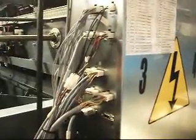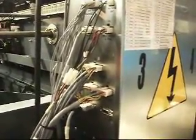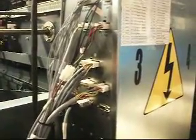And just because I haven't got the book out right now to give you specifics of it, but those are your solenoids and switches. You got the switch that's operating the shark, and you got the solenoid to power the shark to flip the fin back and forth. So you'd want to check on these connections of your pin solenoids and switches. You got your left hand function side of the machine and a right hand function side of the machine. That's on the rear elevator. I didn't dig the book out for this to tell you in detail.